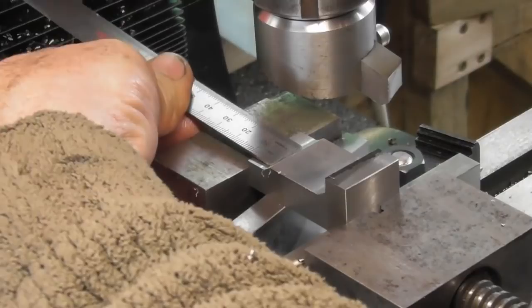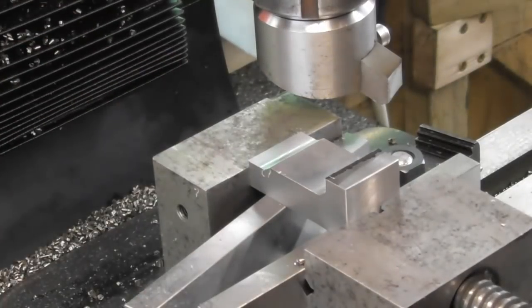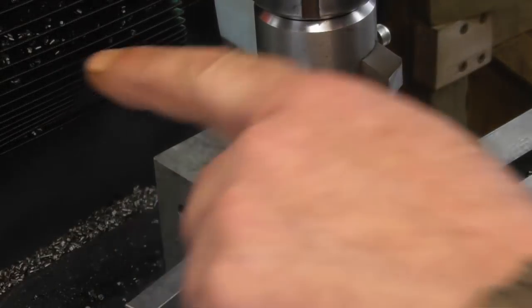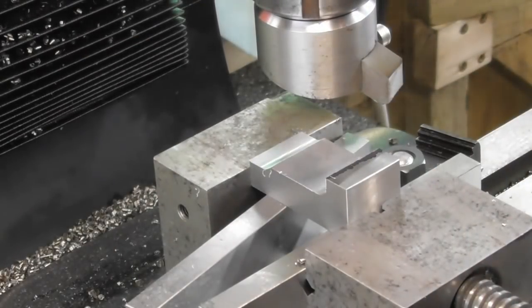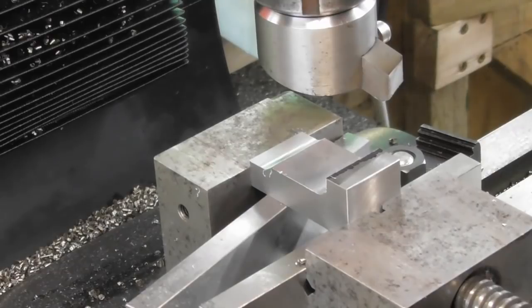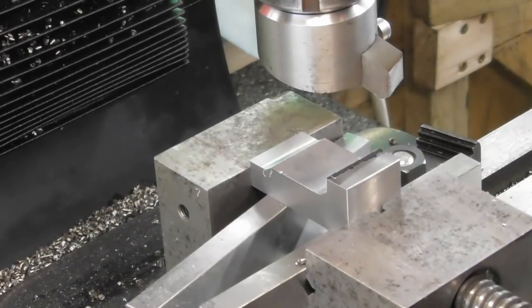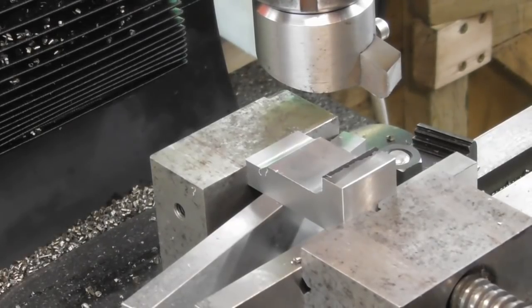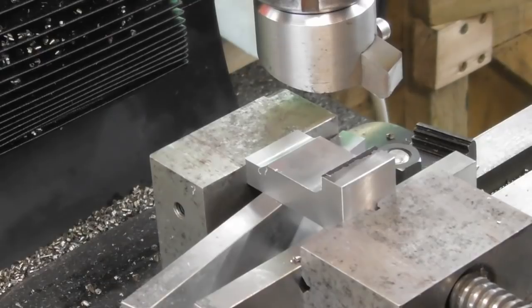Yeah, I've got 8mm of parallel there. I think I could do with a bit more. I'm going to feed back in this way another 2mm. So I'm going to come back up to my 7.5 and I'm just going to re-hit that with another 2mm. So I'll just loosen the carriage off. Right, that's 1 on the dial, 1.52.